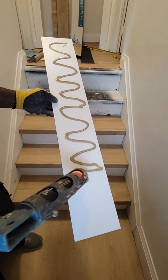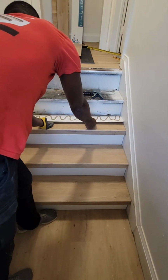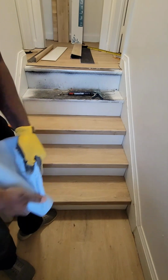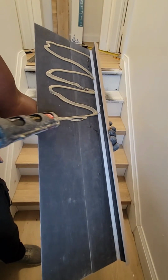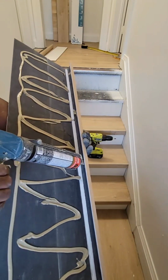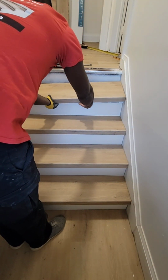But we do, as a business, also sell those nosings. So the nosing is the front part that is bent. It is made out of the vinyl plank board that's there. And so you can see here that line down the middle, that is where the board that's been bent into the nosing is connecting to another piece that's going on. This really is the magic of what we do with these vinyl plank floorings, bending them into nosings. Because you're no longer ending up with a difference in height or a lip covering that end bit that is traditionally called a nosing, that would then have to go on top of whatever is on the top of the tread. This is all one piece.